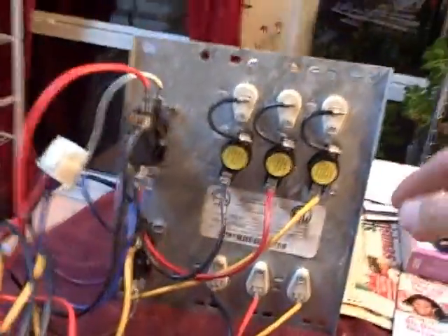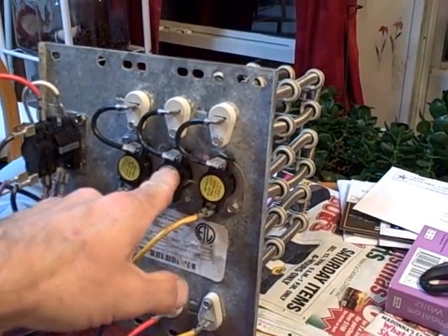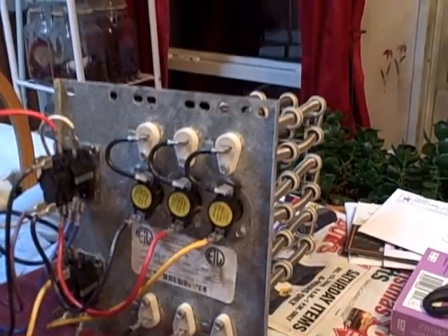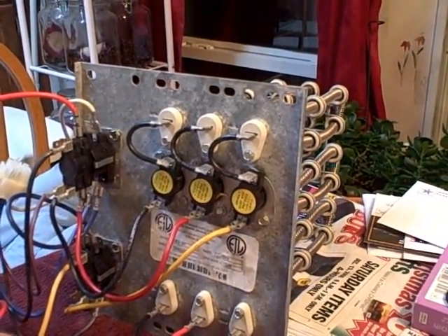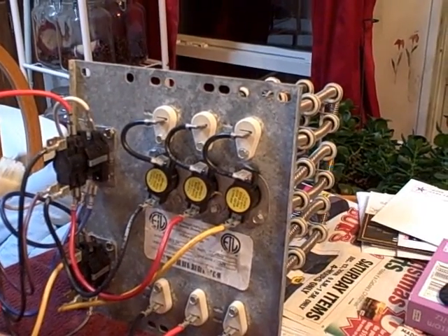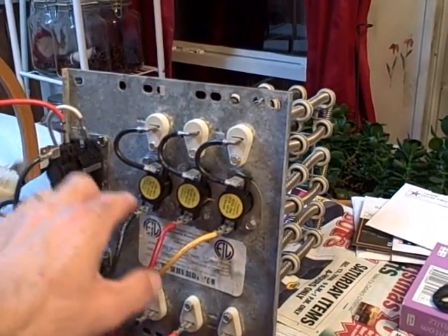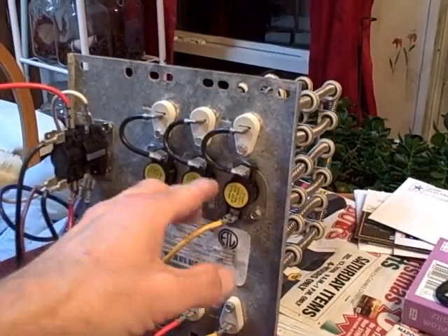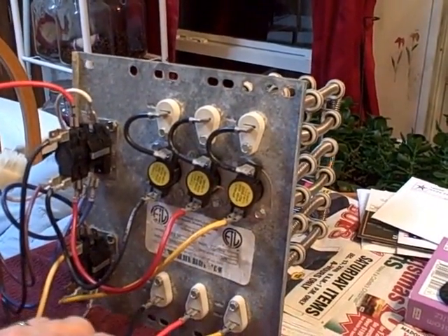The devices you're looking at here — we have power coming in through the coils and coming back out. These are actual over-temperature safeties, or thermal safeties. Should the blower not be working, or you have an insufficient amount of airflow, or a clogged filter, and it gets too hot in the heat chamber, one or more of these little suckers will pop off, cutting the flow of electricity and thereby taking that coil out of the loop.